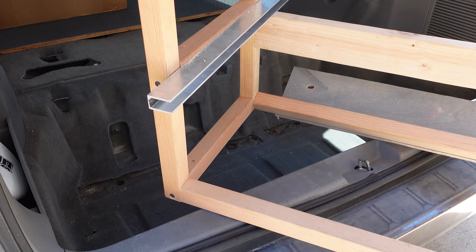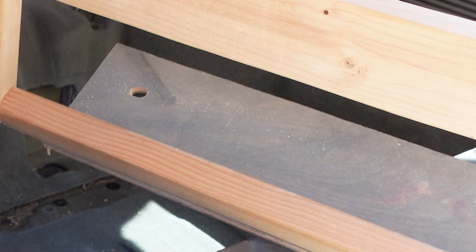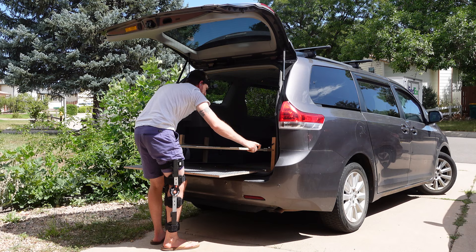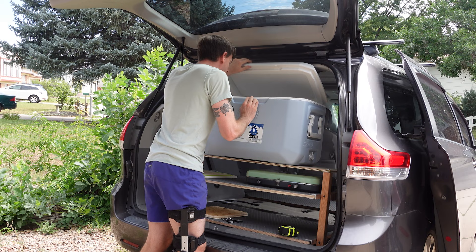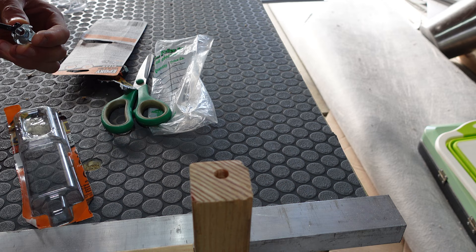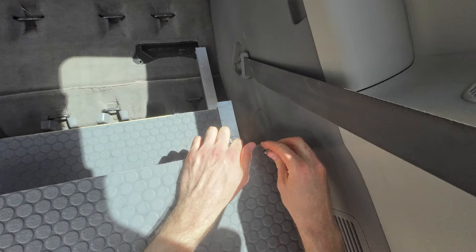The frame is made up of one two-by-four, two-by-twos, and aluminum U channels. In the back, a piece of plywood is bolted to the floor. After bolting down the frame, I slide back in the two shelves — one for the kitchen and one for the pantry floor — with four T-nut bolts for the inch-thick top shelf. The first time I realized my frame was too tall so I had to drop everything down about five inches. I also tried half-inch hardwood up top but it was too weak and the T-nuts didn't stick, so I used Gorilla Glue two-part epoxy and hammered it back in. With those fixes it ended up incredibly strong.